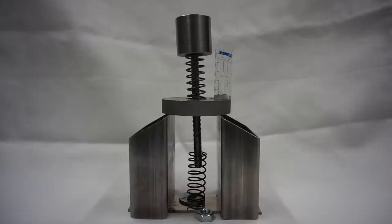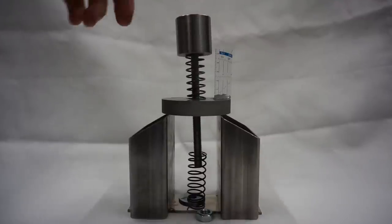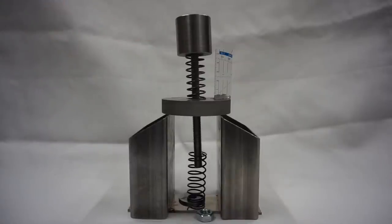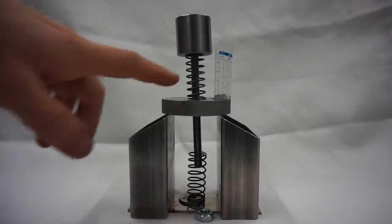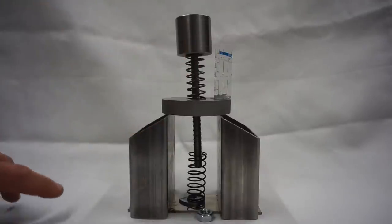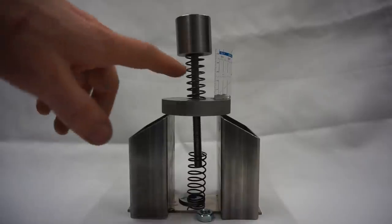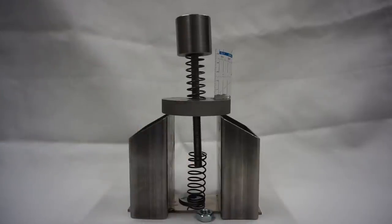But before we proceed to the practical part, a word of caution here. We just considered axial forces so far. Machine tool spindles must deal with all sorts of axial and radial loads and combinations of them. This complicates the preload determination a bit. Also, in our model case here, we have two identical springs or two identical bearings. Your spindle may have such an arrangement, but spindle bearings are not necessarily of equal size. Also, we almost completely neglected spindle and housing deformation here, because our model springs are so much more flexible than the threaded rod and the plate. In reality, this may not be the case, particularly with very rigid roller bearings.